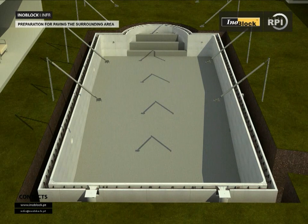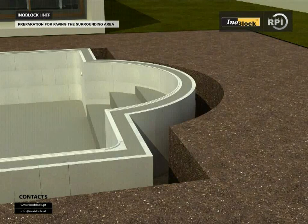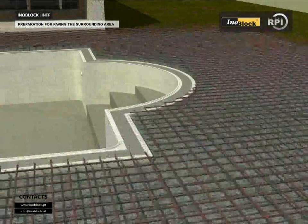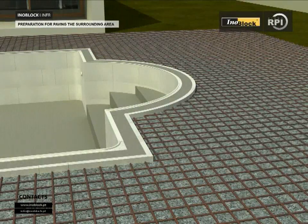After 24 or 48 hours, remove the bracing bars. Backfill the trench around the pool: cover the exposed tubes with sand to protect them and backfill the trench with earth or hardcore. Install steel mesh at 4 or 5 mm diameter.